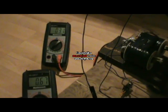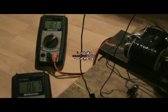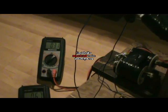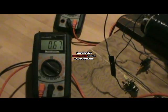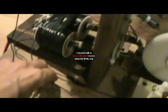So it looks like we're settling down at 3.1 AC volts with our little measuring coil under there. And we have 0.67 amps going in. Now let's click the big boy. These coils, I should say, this has the least amount of wire in the middle, and here's the big boy. Each one of these spools has a full microwave oven secondary wound on it. So here we go. But it's not thick wire. I'm going to click her on.